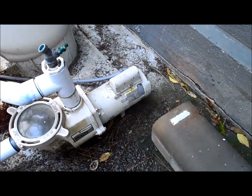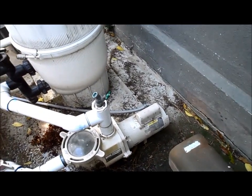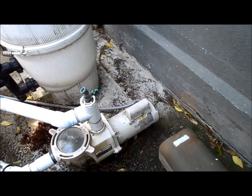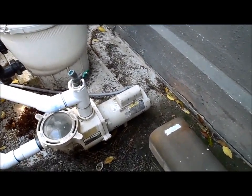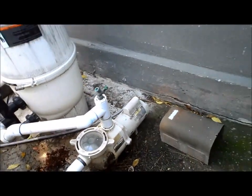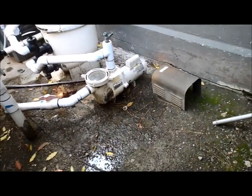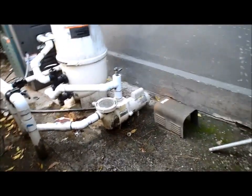That's the sound your motor will make when it's starting to burn out. You can hear that high-pitched sound. Sometimes it will make a more grinding noise also. But that's definitely the bearings wearing out. And like I mentioned in my pump video, it's time to take it off and get it rebuilt — rebuild the bearing. It will give you a couple more years out of your motor.